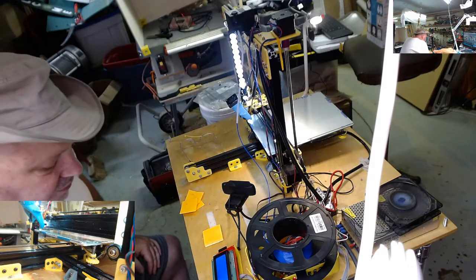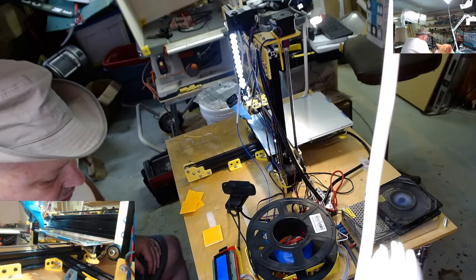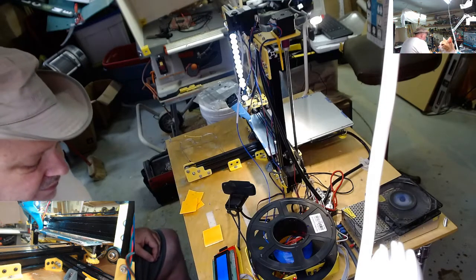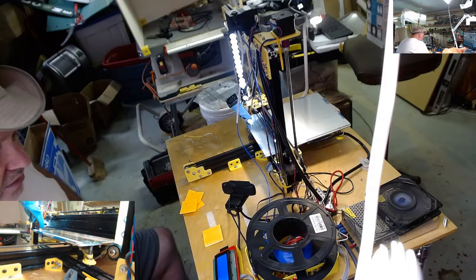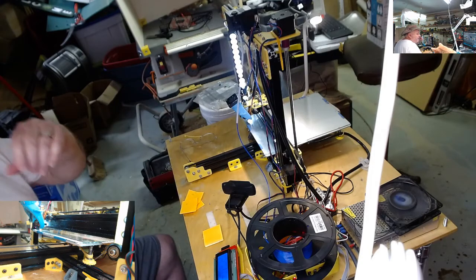All right, we're back at temperature again. Let's go through the bed leveling process. I'm going to prepare bed leveling. I have my own menu here to level bed. I don't want to level bed that way. Oh, we're not doing all that. That's crazy. Mesh bed leveling is awesome, but I don't care about that right now. I just want to do the four corners because I think I'm going to put a MOSFET on tonight. Fair. Preheat PLA. Tell it to do both. And away we go.